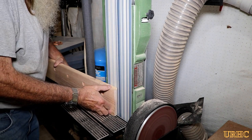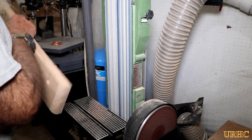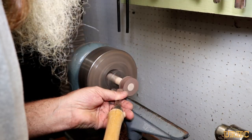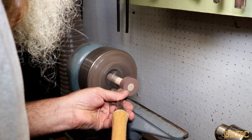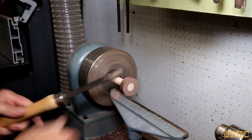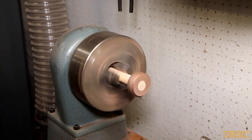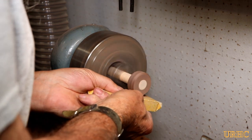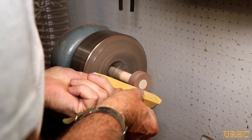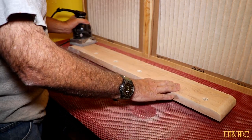For the rack itself I decided to sand some big radii on it like I did on the ends of the night tables in that room to kind of make it match that look. Once the bolts were dried I put them on the lathe to clean them up a little bit, put a couple chamfers on there to break the edges, then sanded them all down. My wife started calling everything I'm making in that guest room 'industrial rustic,' so I guess that's the term I'll use for that style now.